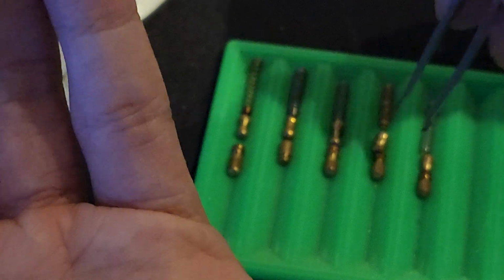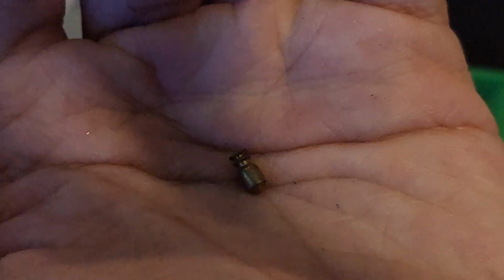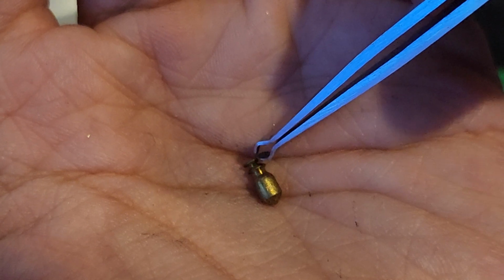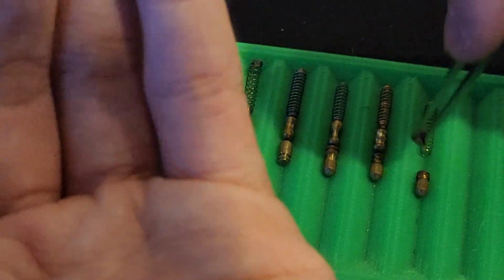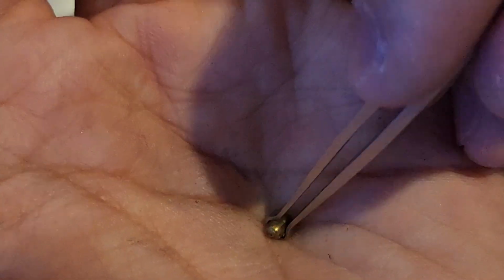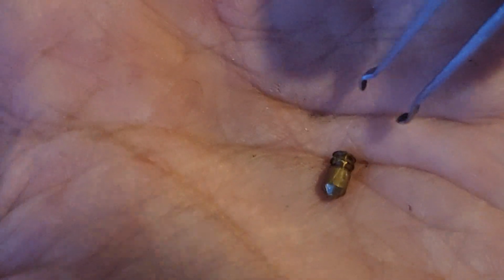Definitely the reason why I had to keep going back to one, because it would drop every time I set it to one of those spooling bits in the serrations. Here again we have serration here and then such a deep sort of graduation there that I would say that's spooling. And here we have a little tapered pin. And with that there is a serrated key pin.